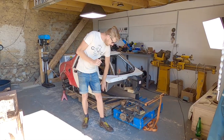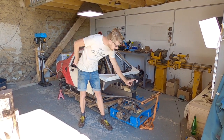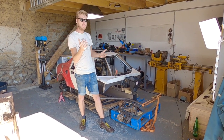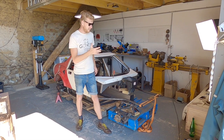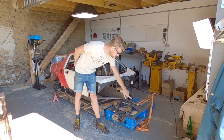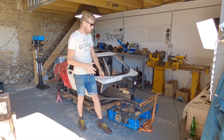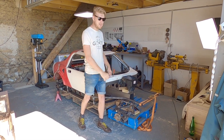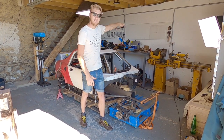I've made my panels fit and then removed them because the clamps were getting in the way for the next job. I've also made this little suspension jig. In a perfect world I would have made a really big suspension jig, but because we're making chassis legs I want something unintrusive that I can keep in place. This little brace is reversible — it works for both sides — and holds the suspension roughly in the right place with some adjustability, good enough to get everything where we need it to be. I've drawn out my front suspension geometry and stuck it to the board over there.